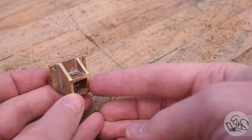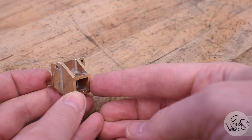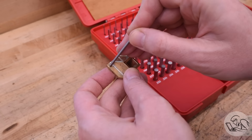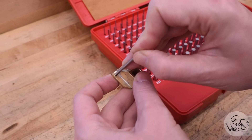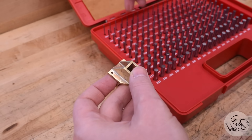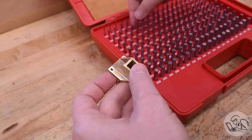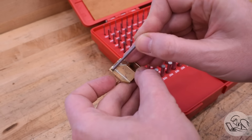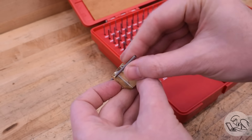In a nutshell, filing buttons are hardened steel pins that act as file guides. They center themselves on the hole in question. So the first step is to figure out exactly how big that hole is. I drilled these holes so I know roughly how big they are, but drills can cut oversize, so I'm using gauge pins to make sure. The more accurately the filing buttons fit, the better the results will be.